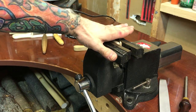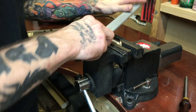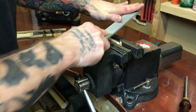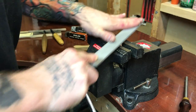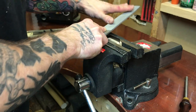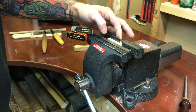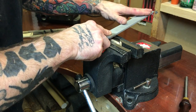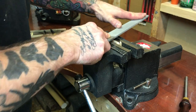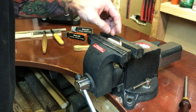This is a Nicholson bastard file, and what you want to do is — perpendicular to the cutting edge, at an angle — bring it down to a 90-degree angle on both sides. Forgive the noise. You want to maintain that same angle the whole way across and get both of those round corners off and get them to 90 degrees. The closer you get this to 90 degrees, the better the next step will turn out for you.